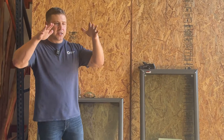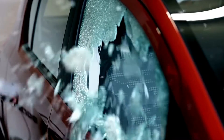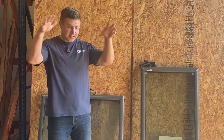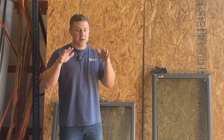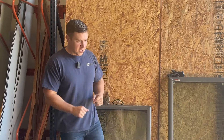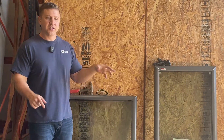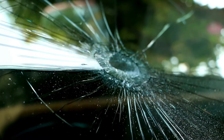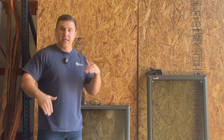If you've ever had the side windows of your car busted or broken into, you'll notice that the glass breaks into a million different pieces — it's very hard to clean up, you almost never find all the pieces. That's tempered glass. The side glass in your car is all tempered glass. If you notice your windshield, everybody's had a rock hit it, and it just cracks — it never really breaks all the way through. That's laminated glass. That's the key difference between tempered and laminated.